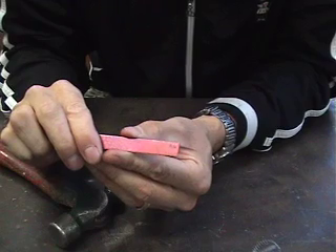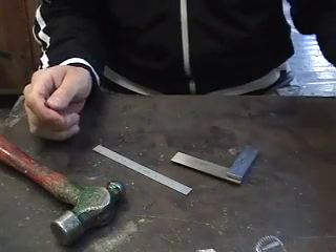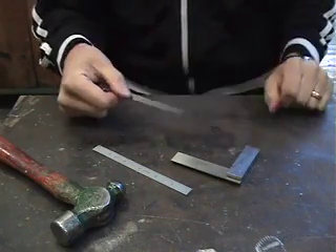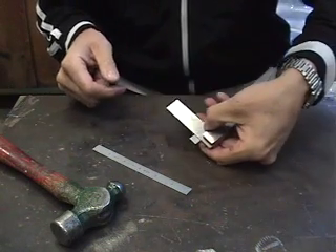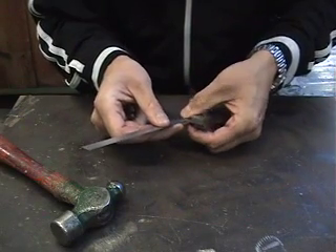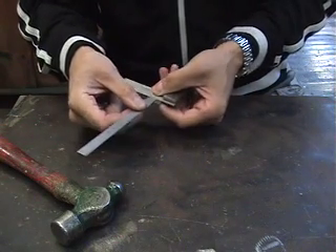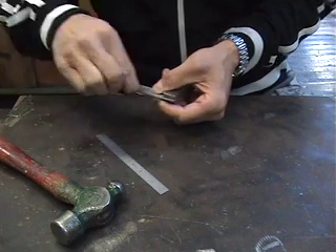That's the best way to do your initials. Now here's the layout for the hole. The hole is located on the opposite end of the initial, so here's what you need to do. Grab your piece. I like to put my scale down here — you can see I have a piece of my metal sticking out. I'm going to slide it up on the ruler so it reads a quarter inch, because it's spaced in a quarter inch from the side. Make sure it's perfect. Use the scriber to scratch my line.